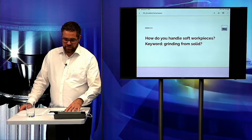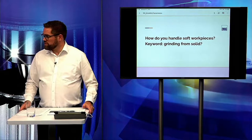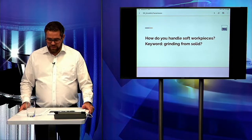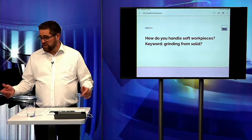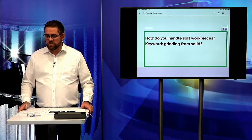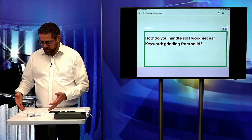Alex, that's a question where you more or less answered already, how to handle soft workpieces. You answered this already. And the question is also about grinding from the solid. Here, I think I will answer. Grinding from the solid with thread wheel grinding is not a process which we are doing. Theoretically it could be possible, but the costs are really high for the tool wheel. So for grinding from the solid, profile grinding is the better idea.